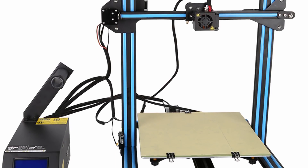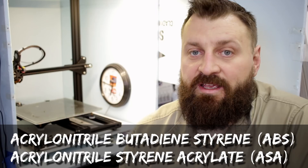I don't want to make this into a 3D printing how-to video, but I do want to quickly touch on a few key details. These pods are going to be super strong, UV stable, and able to stand up to the temperatures of a truck cab. For that we need to print with ABS or ASA. PLA filament is much easier to print at lower temperatures, but it would be a non-starter for outdoor use as it is biodegradable and will break down in sunlight.